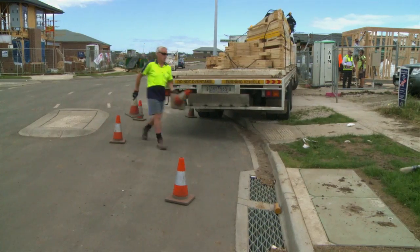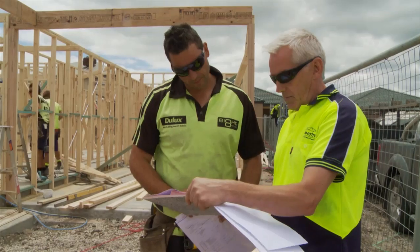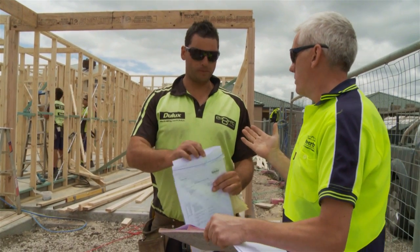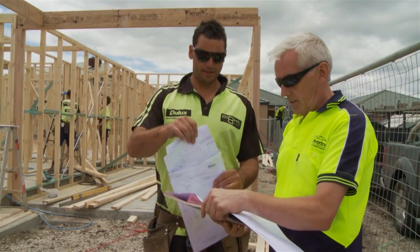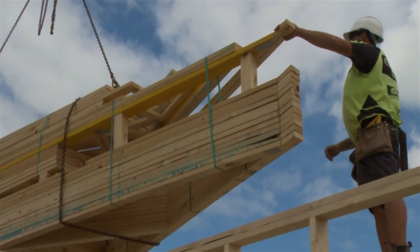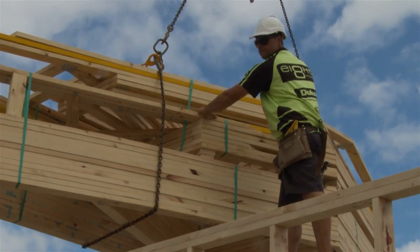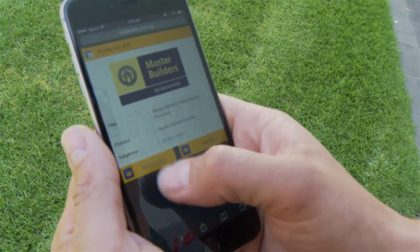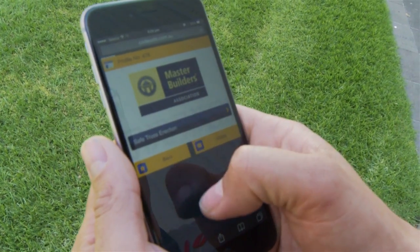Part of the preparation will involve your traffic management plan. Plan out the best position to place the trusses either on the ground or on the top plate to minimise any manual handling issues. Where trusses are to be directly loaded onto the top plate, a competent person who has checked the structure should direct and control the lift, ensuring correct support is provided. Refer to the documents section on this profile for more information.